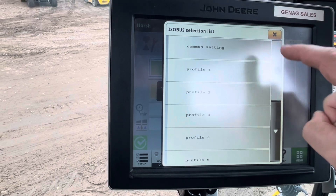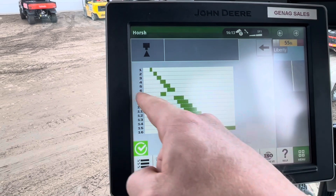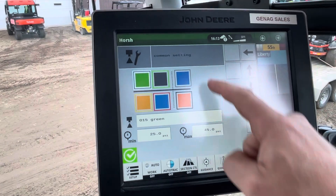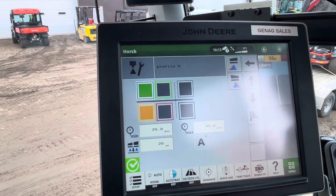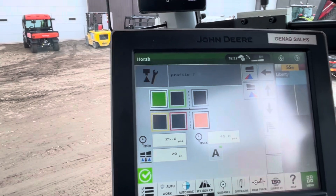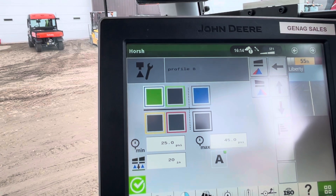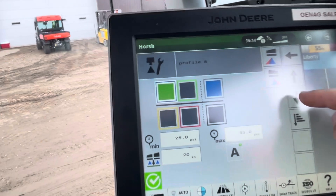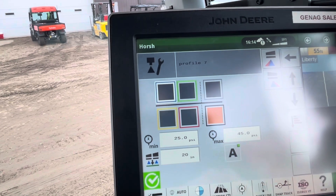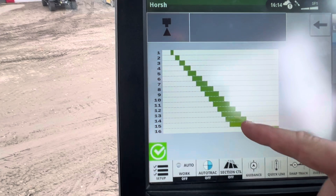If I want to switch between profiles I can tap the top box and it scrolls through all the different profiles. Going back to the common setting, this button shows you the different profiles and the overlap. It looks like I did one of them wrong — number seven is incorrect. Let's look at profiles six and eight: six is a two plus 1.5, so that's 3.5, then it dropped to 2.5, then jumped to 4.5. So I need to find a four somewhere — a three plus a one. Turning off the wrong tip and turning on the correct one, this looks a lot better now.